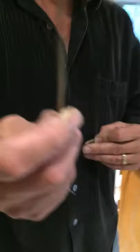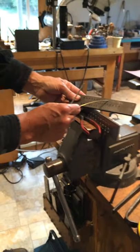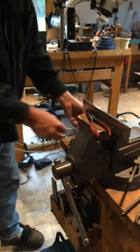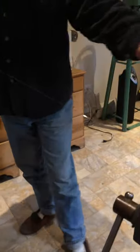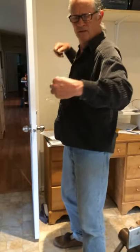Then I bring this smaller wire over to the draw plate. This is the draw plate I use to start. I feed the wire through these progressively smaller round holes until I get to the last hole here. I'm going to pull this wire through — this is less than a quarter of a millimeter in diameter wire. It's like a hair.